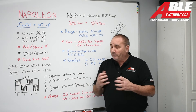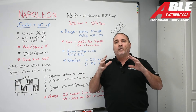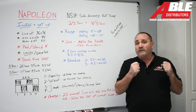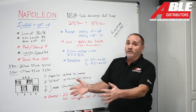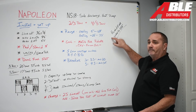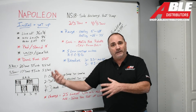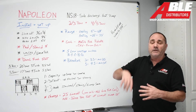One more thing when dealing with heat pumps: humidifier wiring. If you wire the humidifier off the humidifier contacts on the furnace board, those typically will not energize the humidifier in cooling. Remember that when you're in heat pump mode, the furnace still thinks it's in cooling. So set your humidistat up at the thermostat to work anytime it needs humidity — that way you can add humidity even with the AC on in heat pump mode. Just remember to shut the humidistat off come summer so you're not adding humidity.